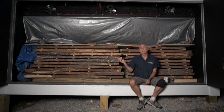If I was to build a kiln again, I might change two things. One is the fans. They are currently hooked up directly to the solar panels. A better arrangement would be for the solar panels to be charging batteries hooked up to a thermostat which controls the fans. You don't necessarily want the fans to be running during daylight. You want it to be running when the kiln is at its hottest, which is going to lag behind daylight hours.